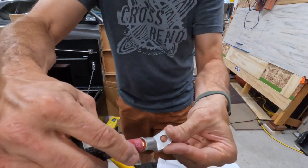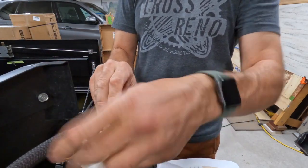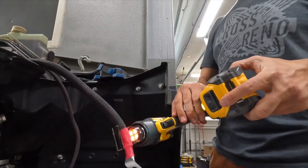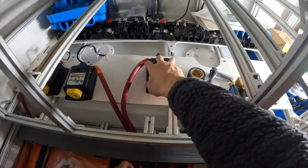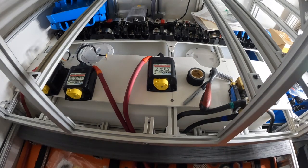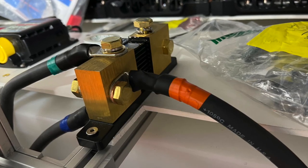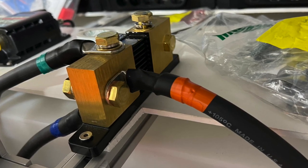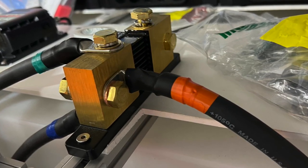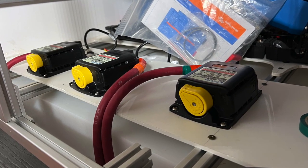I've got my angle bent here, pushing the copper wire all the way up into the lug as it's crimped. You get a nice solid connection. You get these bent connections at any angle you need so your wires don't have any strain on them — everything can be exactly in the place you want relative to the components. You get a nice straight connection in and a solid connection with the devices you're trying to connect to. Some really good tips to hopefully save you from having to stock a lot of different angles of lugs.